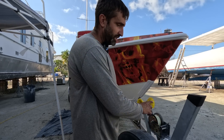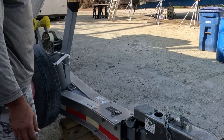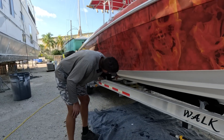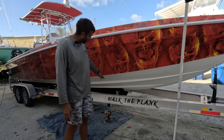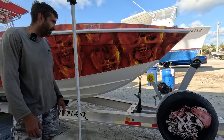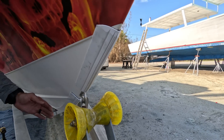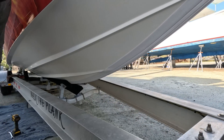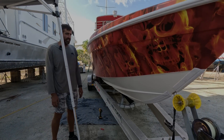We dropped the front part and the winch down so we could have space to put the keel guard on. We lifted the trailer up with a forklift — usually we'd use the actual lift here but it doesn't have a handle. Once we got it lifted up enough, we put a little pallet stand with some sand there just to support the keel. When we dropped the trailer back down, it took the weight off the front bunks. The two front bunks were in the way of the keel guard, so we loosened those and slid them out of the way. Yesterday I prepped the bottom by scuffing it, applied primer, then applied the keel guard. It runs from here all the way to the back. Now we just have to put the trailer back together and get the boat on its way.